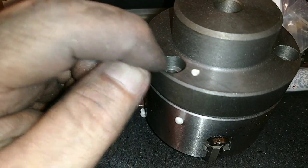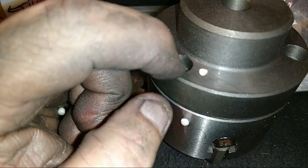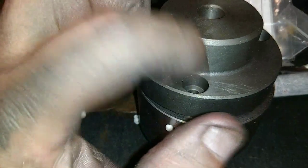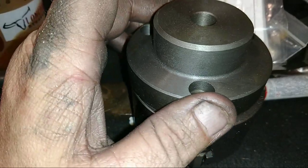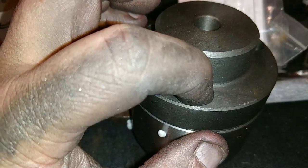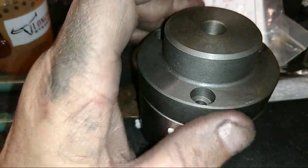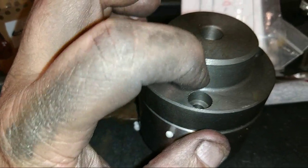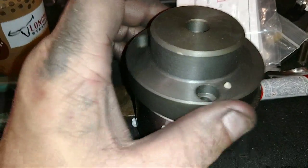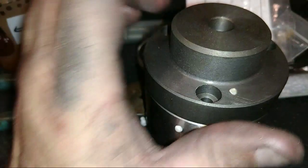Now, the only thing I have here at my disposal is a drill press. And I want a flat bottom hole, so I was thinking buy a cheap high speed steel end mill, drill these holes, and then flip them over and line up on them, put the drill bit back in there, line it up, clamp it back down, take the drill bit out, put the end mill in there, and then counterbore the hole with an end mill. A little cheap Harbor Freight end mill or something. Yes, sir. But all I need is to go down enough for the depth of the head.